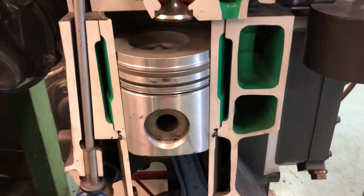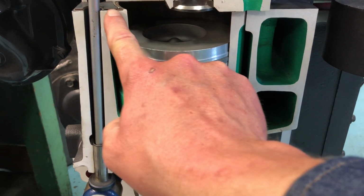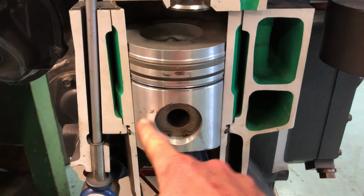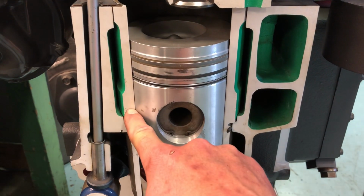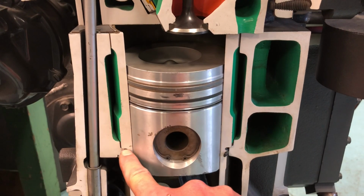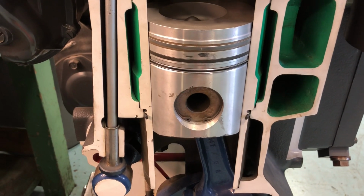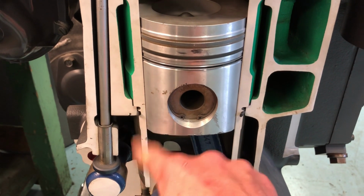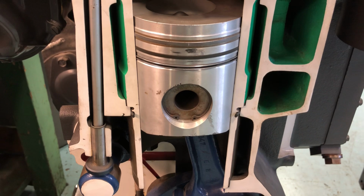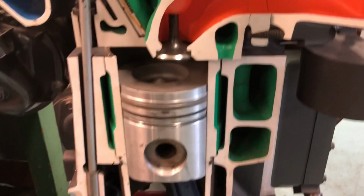Here in our cutaway, you've got your cylinder liner. You have no machined stop surface on the top here. So here you can see your piston riding within your sleeve. No machined top stop up here. It's down here. That is the middle of the liner. Therefore, that is a mid stop. There's sometimes an O-ring down there. Sometimes they can even just be sealed with RTV. These ones, like I say, much less prone to leaking coolant down into the crankcase.